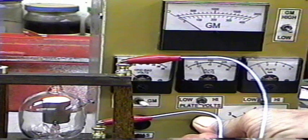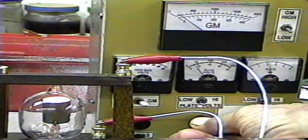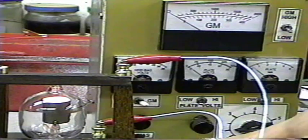Now if I run the filament up — I'm going to put it to two and a half volts — see, our current goes way up. And we're getting a good half a milliamp with three to four volts on the plate. So the tube is absolutely excellent. Okay, if you like this video, please subscribe. I have another one coming up — the next one will be making a DeForest Spherical Audion tube, coming up next month.